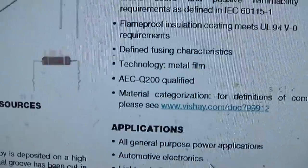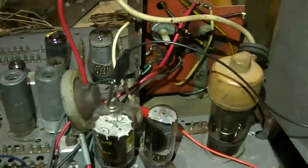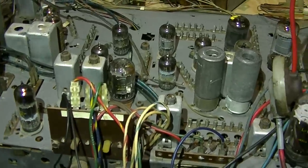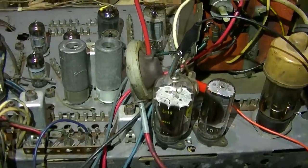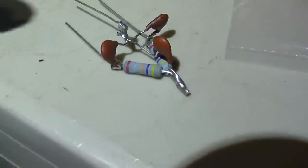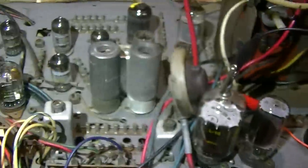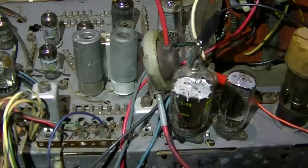Standard 25-cent resistors have a voltage rating of only 350-500 volts, so those are not going to be good inside the high voltage cage where you have a huge drop. Back a week later - getting everything set back up. I ordered all the resistors from Digikey last Saturday night and a week later they're still not here despite paying for three-day shipping. I made the integrator and I'm getting all set back up.